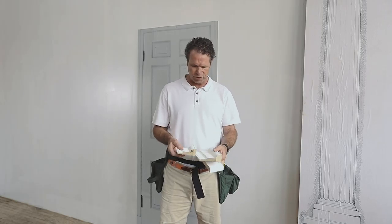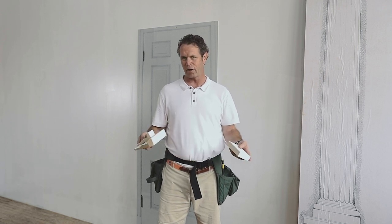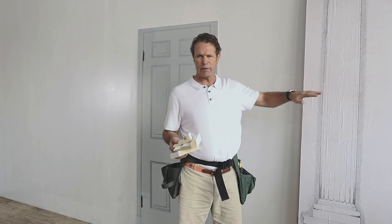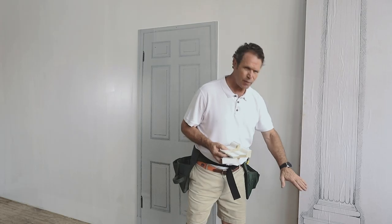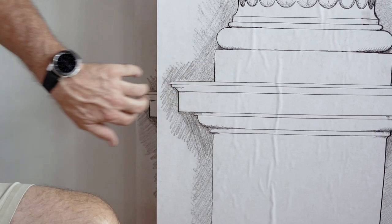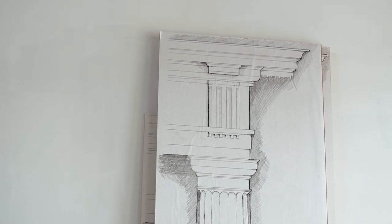And I've actually got two scale and sizes of moldings here so that we can create hierarchy. Remember, we're gonna use this as our reference piece, right? If you watch my videos on classical design and kind of how that works, you remember that there's a proportion and scale to the moldings, okay? That there's a narrative, there's a, you know, feminine versus masculine nature. Remember that all the moldings that we use in the house come from this system: base, chair rail off the pedestal, architrave, crown moldings, right? All of that works from this system. So we're going to use that as a reference.